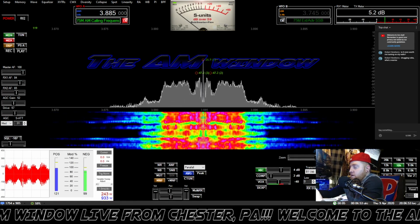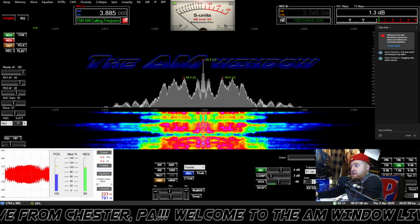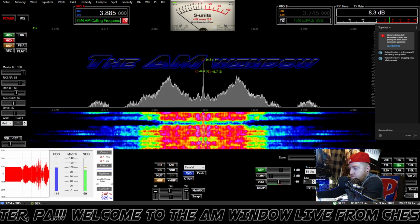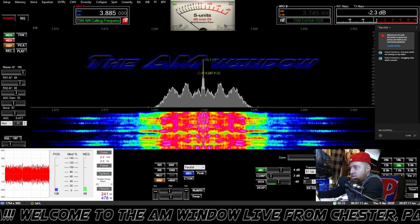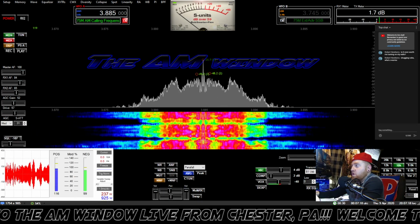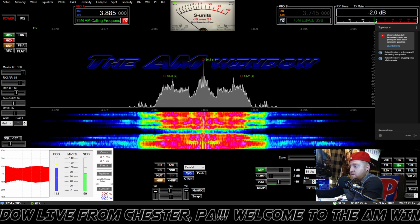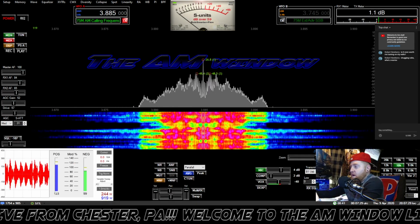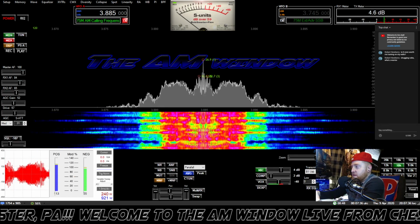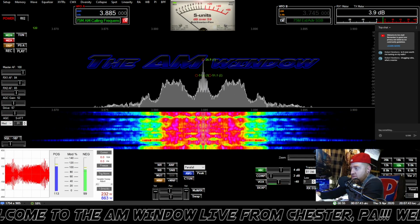Art, I have a handheld shortwave that I can put all the ham bands in, and I just tune it to the affected frequencies, and once I get close, it also has a digital signal strength meter on it too. Then I can tune it to the AM aircraft band, and I can hone right in on it with that. I bought it for like $60 off of Amazon. Thing's been a lifesaver. And if I need to, my father's got one of those MFJ directional noise finding little receivers, and he has a handheld Yagi hooked up to it. Once you can really hone in on it with that. I've had to use that before.